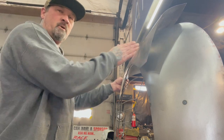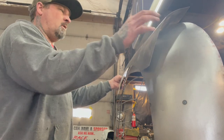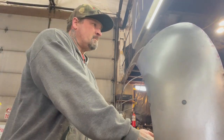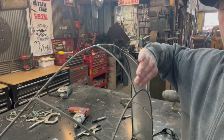Right here I have a bunch of hammering to do, and then I've got some tuck shrinks so I can get it to move around where I want. But the panel's pretty beat up right now with all the hammer marks, so I'm going to go ahead and put it on the English wheel and knock those out before I do anything else. On the English wheel I'm running a wheel that's not smooth — it's got a very little crown or radius on it. You've got to be careful not to raise that panel too much, because it's hard to shrink something back once it's gone that far. You could end up throwing the panel away.